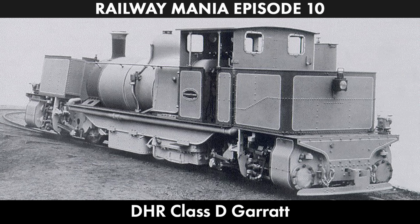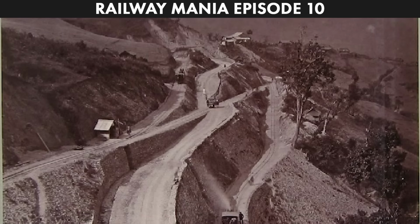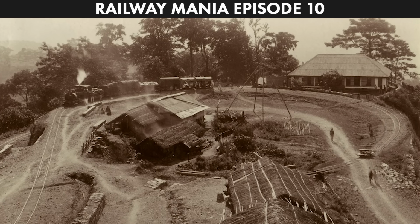The locomotive was powerful, but the Darjeeling is incredibly steep, meaning that as water from the front tank was used, the weight on the front bogie decreased and it slipped with heavy loads. What's more, doubling the power and doubling the length of trains had its own problem.